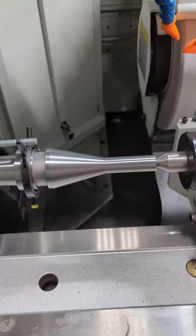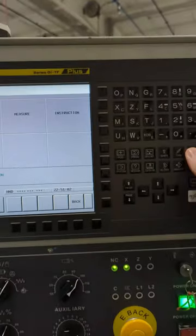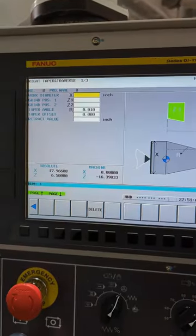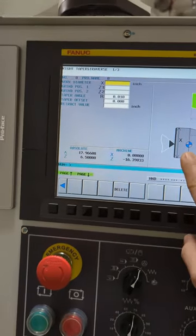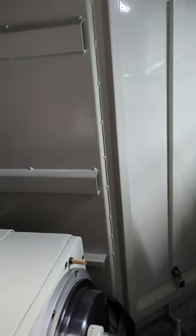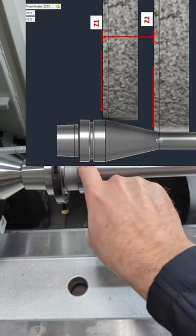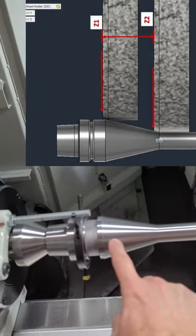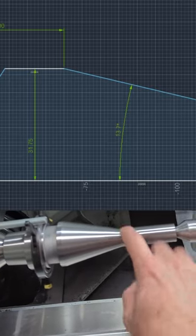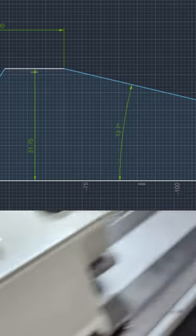So it worked out well. And if I go in and hit enter, here's the inputs I need. I need a diameter to start with. So if I come up here, I start on here, but this is a calculation. If I start here at 2.5, you could do that, but you need to know your angle. And you want it on center, you don't want included. So if you have a print saying included, divide it by 2 so you get this. Because that's really what it wants.